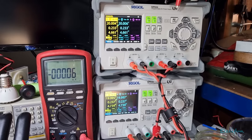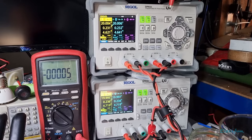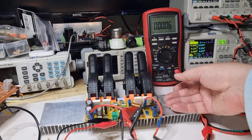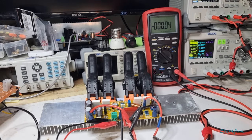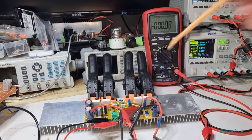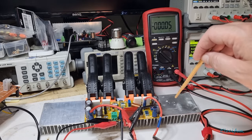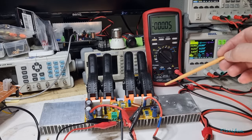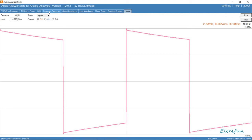Just doing that on single shots — we're up to 232 and it's dropping off. That's because this is running in Class A so it gets hot. This is quite warm here as well. I had to use two heatsinks because with just one the heatsink got really hot, so I've had to put it on two to try and share that.